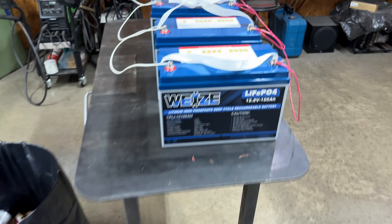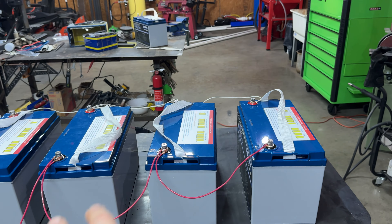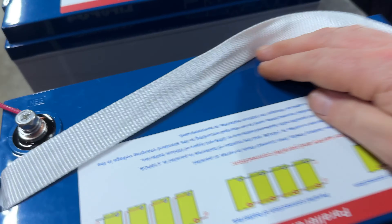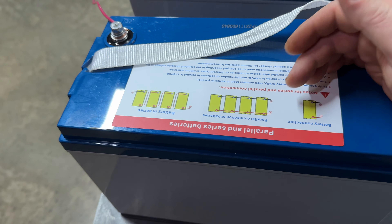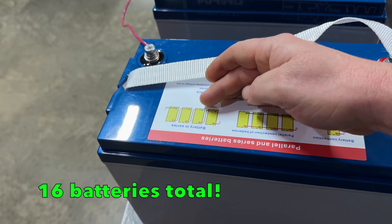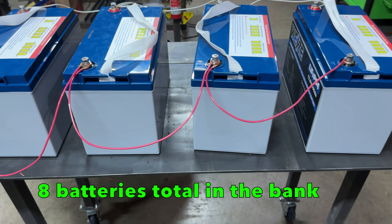Got a surprise update — I ordered four more of these batteries. It's done well enough that I'm going to parallel two more in series with two more in series, then parallel those with the other two, and that'll max it out. According to the diagrams on top and what I've read on the website, you can do a maximum of four strings paralleled and up to 48 volts, which would give me approximately a little over 10 kilowatt-hours worth of power.